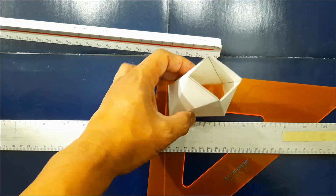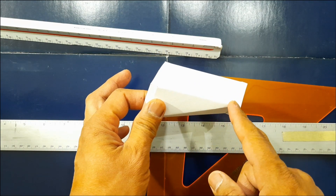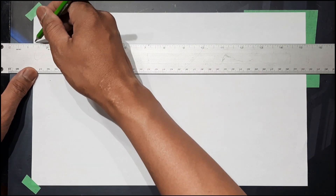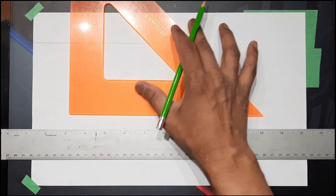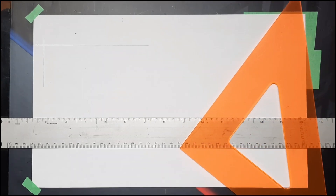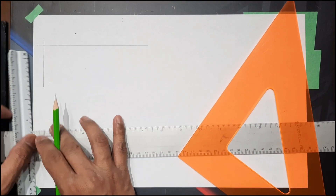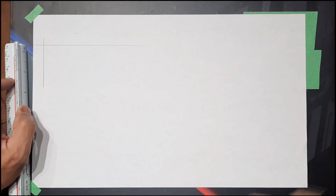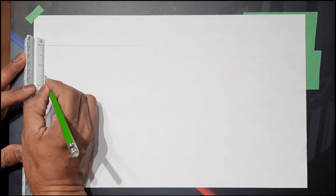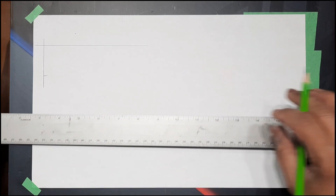It has a vertical height of three inches without the flanges. What we are going to do first is the horizontal line, and then a vertical line perpendicular to the first line. Then measure and mark one and a half, and then draw a parallel line.